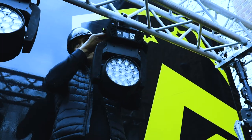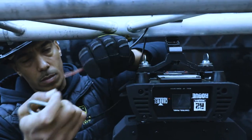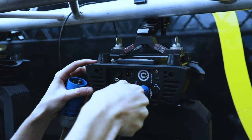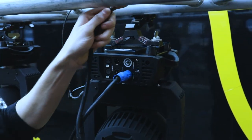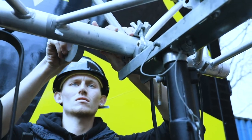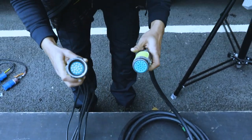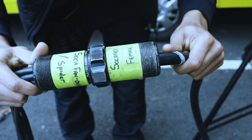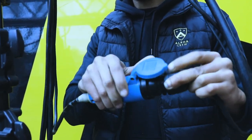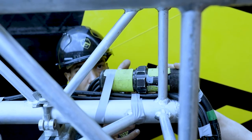Now to hang the lights on the truss — hang the lights with the controls facing stage front. Attach the safety cable as a secondary measure in case the clamps fail. Next connect the powercon: gently insert and rotate clockwise. Run the 16 amp end of the powercon cable along the truss and tape into place. A Soccapex cable run from the distro box will supply all the power for the lights on the truss. Attach a 16 amp fan out to the Soccapex cable so that you can connect the moving light's power cable to it. Ensure that the cable is securely taped to the truss.